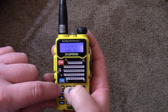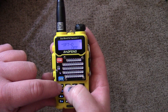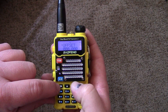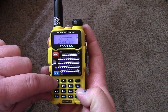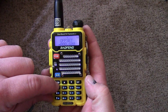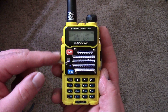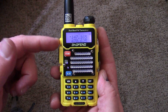Now go up to Menu 25 — this is going to set our frequency shift, either positive or negative. This repeater wants negative, so hit Menu to save. Go up one more to set our offset frequency. On two meters it's almost always 600 kHz. Save that, and we have now programmed this repeater. When we key up, the offset will drop negative 600, so the repeater will be able to hear us and we'll be able to receive from it.